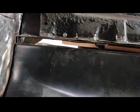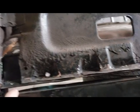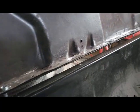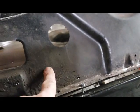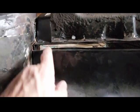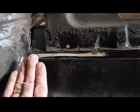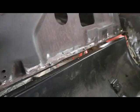There is a good 3/4 inch gap, maybe less, 1/2 inch gap that goes all the way across between the new floor pan and the new trunk pan. And I know it's correct because this is the rear seat panel and it's sitting, if you look right here, I have some screws holding it in place, that's sitting in there flush. So if you have any suggestions on what I can do to fill this up and make it look good and strong, leave a comment below. But I just wanted to show you that.